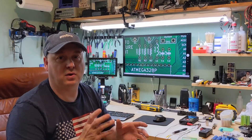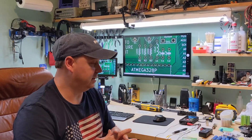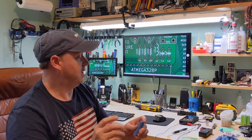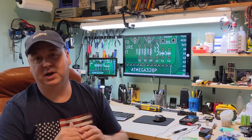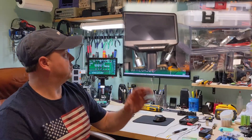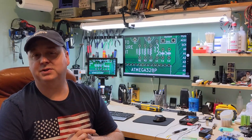In the next video I want to talk about spot welding versus soldering, which is a big debate. I personally like spot welding a lot better. Soldering needs to be done quick and kept cool — it's not recommended, and you definitely want to avoid heat on a cell. I would absolutely never attempt to solder on one that's fully charged — but that's for another video. I hope you found this video helpful. If you did, please like, share, and subscribe. I have links down below for some tools and interesting items I've found helpful — including this charger and tester mentioned in this video, as well as spot welders and other things I really use on my workbench. Those are affiliate links and any link you click helps support the channel. Thanks so much for watching, and God bless.